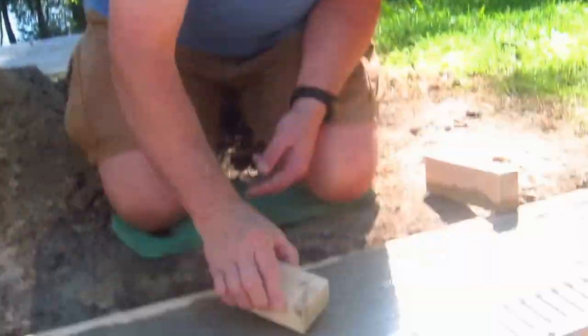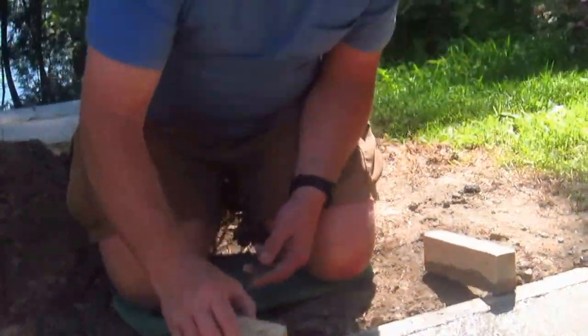You may wonder why I'm not using a steel trowel — a big old tool like you see concrete finishers use. Believe it or not, little pieces of wood like this — they actually make wood floats — work really, really well. This is such a small area that the big trowel would be just too much tool. A little block of wood will work great in a situation like this, and you probably have one around your house. You don't need to go out and buy an expensive trowel and it's going to put on a really, really good finish.